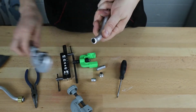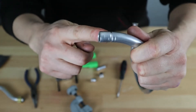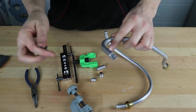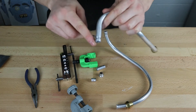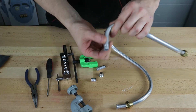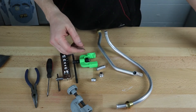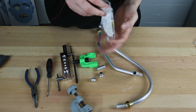All of a sudden I have my groove in place. From the old pipe, I took the rubber washer off — just with a pick, very slowly working it around the edge — popped the washer off, was able to reuse it, and was able to reuse the reverse flare nut with the threading that actually fits up to all of the other pipe threading, hydraulic fitting, whatever it may be.